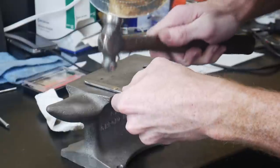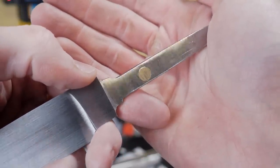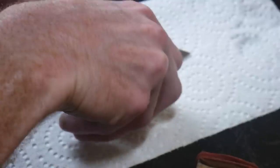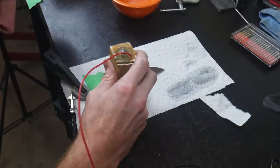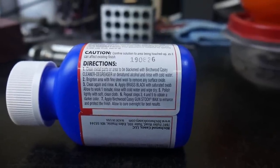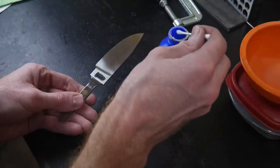We are peening a brass plug into the tang — I'm doing this so as to have a target whenever we drill the pin through the handle material. I want it to impact a soft material so it drills through easily, doesn't create excess heat, and doesn't allow the drill bit to walk. With a Sharpie I lined up where my maker's mark should go based on the shoulders of the tang, and then I etched it in with DC power — about 12 or 13 times in my etching machine — to get a nice deep etch.